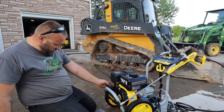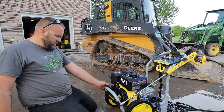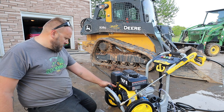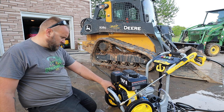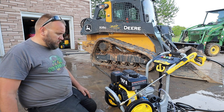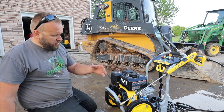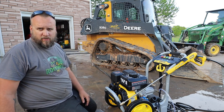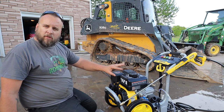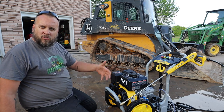The tracks are mostly cleaned out. There's a gas-on switch and a choke switch, and there's a kill switch. Should be ready to fire it up. One more thing before you fire one of these up: you always want water running through it when you start it. And you don't want to leave it running without water going through it, because that's what cools it.